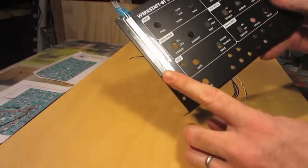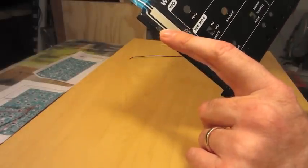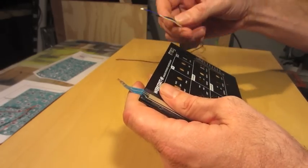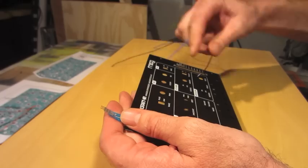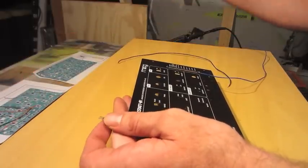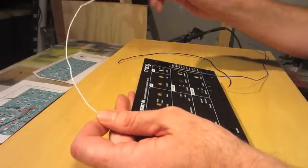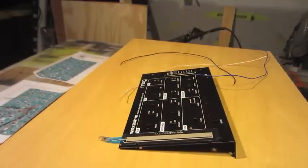Now that I've got the soft pot attached to the case, I just took an X-Acto knife and cut out the two little screw holes. I will fold this over and attach, but first I'm going to go ahead and solder these extensions. I'm going to do the blue wire to the center leg of the pot, the far right wire to black which will be ground, and the left wire will be white, and that will lead to the pot for the range adjustments.